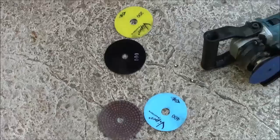Now we'll do a little bit more with the 50 to bring out more of this stone aggregate and shave off more of the top, then work our way up on the higher numbers — 100, 200, 400. Here's a look at our progress after stopping with the number 50. You can see all of the aggregate coming out and those blue marbles starting to show up. It's getting really nice and smooth. Now we'll go ahead and switch to the number 100.